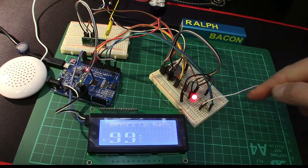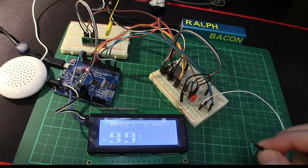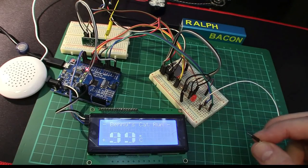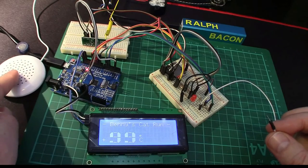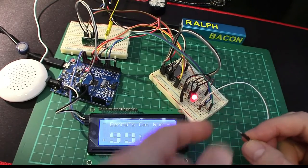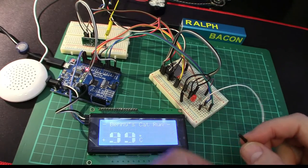There's about a half-second delay because there are no interrupts, which is why it's a little bit laggy — but okay for this purpose. The idea is that having been warned by the speaker and beeper, you don't want to be warned every two seconds, which is roughly how often it cycles. So you can say 'right, you've told me, I've brought the cat in' and switch it off.